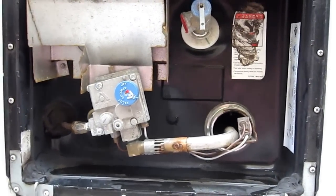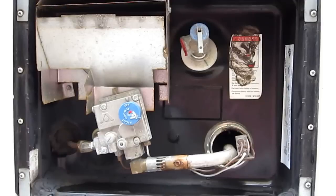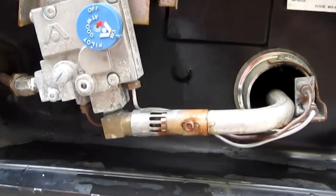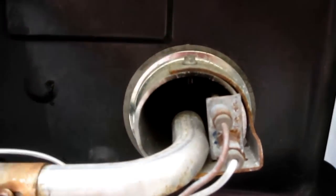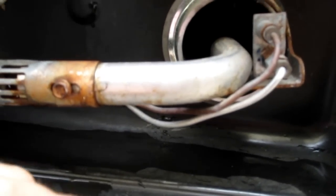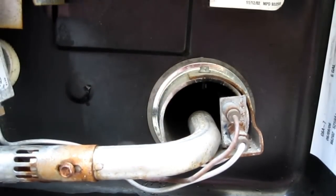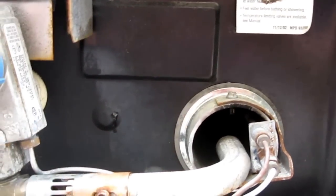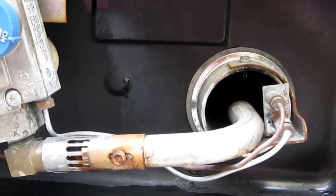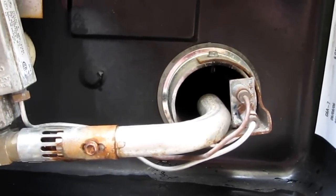You'll have a little bit of vinegar coming out of the faucet, until it's clear and you don't have any more smell. And that's pretty much it for the water heater. I did remove this part here, which has one screw here and one screw there, and I removed this screw and moved this away, and actually cleaned the inside there with a little piece of plastic rod that I had in my garage. It's flexible. Just feed it through the hole and attach a steel wool at the end and just pull it through to remove. Make sure there was nothing.